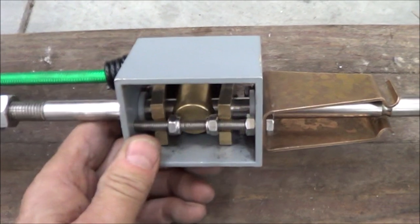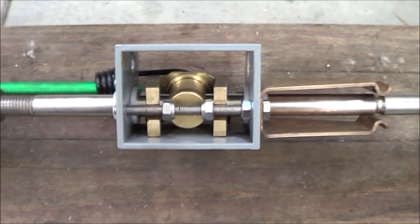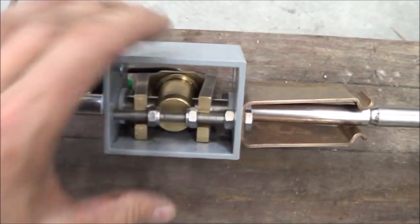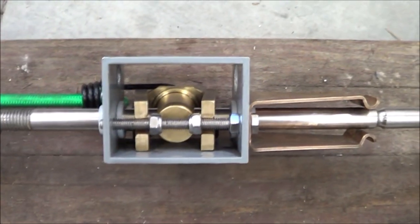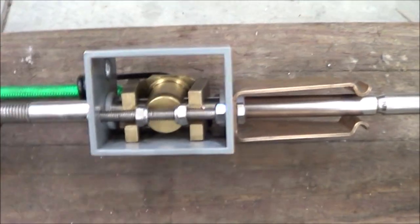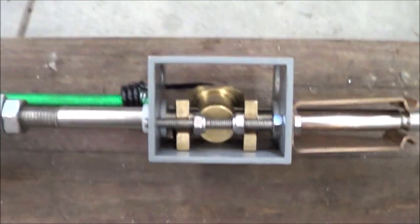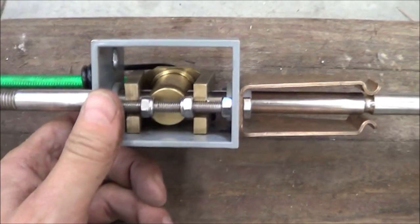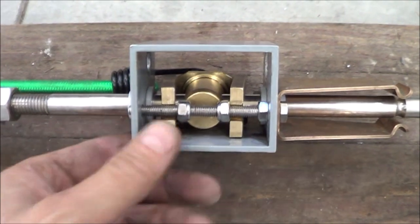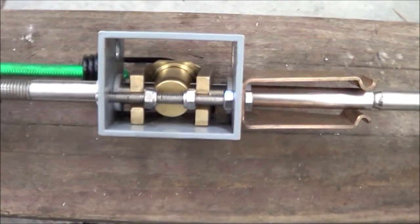Now, some people might jump in here and say, no, wait a minute, the real reason people are going to a hydraulic reverse is simply because they can't get into reverse when they're at throttle. The reason being is that there's a lot of hydraulic resistance to lowering the bucket. There's flow through the jet pump, and then there's water that you're dragging along behind the boat, and both of those make it very difficult to lower the bucket. As a consequence, they go to hydraulic, and there's really nothing else you can do. So I decided to devise a test to find out whether this thinking is correct or not. Is that force really as big as is being implied, or is there something else going on?